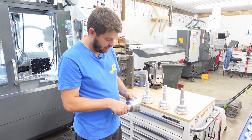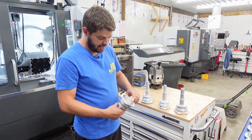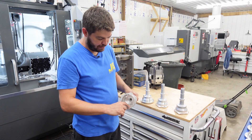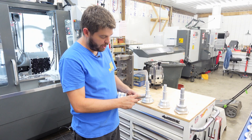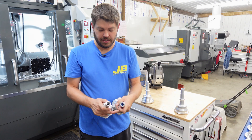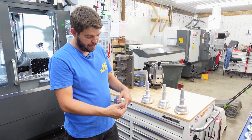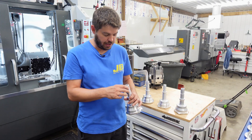It's now coming out of the machine with this hole fully deburred. This slot down here is fully deburred on both sides. There's some internal stuff, some wires that come out of here and it gets a grommet — this hole is now deburred on the inside. Years past it would have to come out and get deburred by hand. We're boring this hole with an eighth-inch end mill instead of just drilling, and you can see down in the middle there are no burrs from that process. Because this gets a brass bearing bushing pressed in here, when those burrs are in there you've got to get them cleaned out so the shaft goes through — it can be kind of a nightmare.